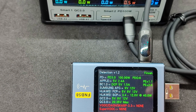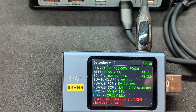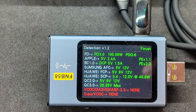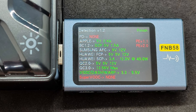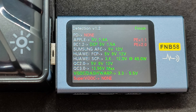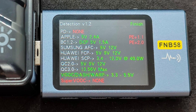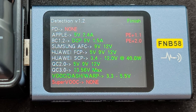The second and third Type-C ports support Power Delivery 3.0, up to 100 watts. Otherwise it's the same, although Huawei SCP showed 40 watts on the tester, while the previous more powerful port showed only 22. USB-A ports I tested directly without a cable — Power Delivery is not supported here as expected. Huawei SCP also 40 watts. Quick Charge 3 supports up to 13.5 volts, while USB-C ports go up to 20 volts. However, one of the OnePlus protocols is supported on the USB-A ports.